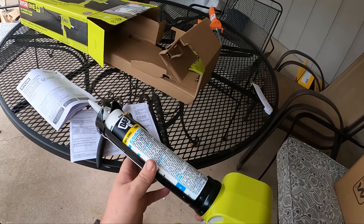So we looked at a number of different caulk guns here. We looked at the traditional one — the smooth rod caulk gun I bought at Home Depot — which is probably what most people buy, where you manually pull it out and release it the old-fashioned way. These do work fine. I think the upgraded way to go is the dripless, where if you push it, it'll automatically push back. The downside of the dripless is that if you do push it up, you want to keep it there — it's not going to stay there on its own.